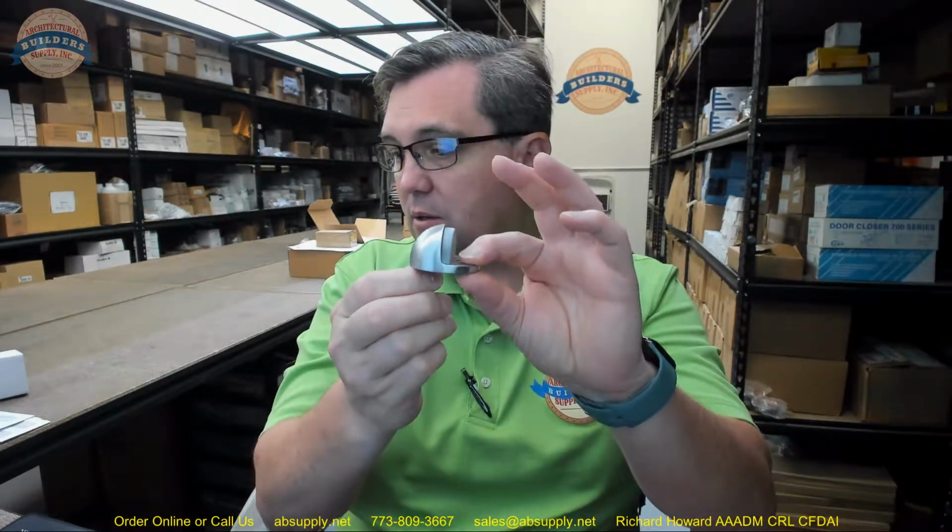Okay, so with that greater thickness of that base, which is going to be a 1/2 inch base versus a 1/4 inch base, you'll basically pick up 3/8 in overall height. So forgive me, I misspoke. You can add a 449 riser to those 440 or 442, 440, 441. Well, you can't use it with the 441 in the sense that you'll have to take into account what you're going to do for a longer fastener.